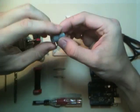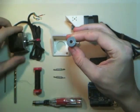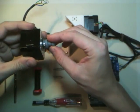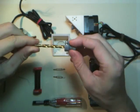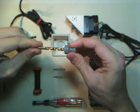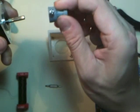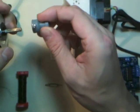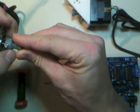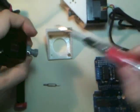The bobbin is 3D printed, and the hole is not always perfect for fitting on the shaft. You can use a 13/64ths bit to clean out the hole. There's a flat on the shaft — you want the screw to tighten onto the flat side to hold this steady so it doesn't move unexpectedly. Unexpected movement is bad for your pictures. The way to hold this so you don't stab yourself in the finger is like I've done here, and then simply tighten the screw.